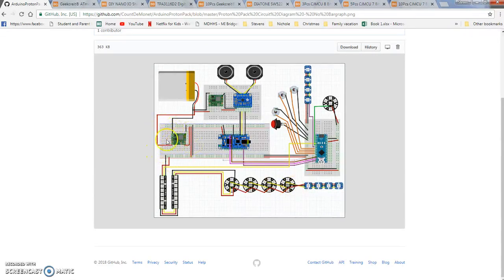This is what we call a buck converter, so it's taking your 11.4 LiPo and turning it into 5 volts and feeding it for this. And that way, this won't fry this. He has 2 because he was noticing some brownout issues with all the lights going. Brownout issues meaning it's dropping below the 5 volts or there's not enough amperage. So you can just use 2. Just don't crush your wires. You just have to keep it positive to positive, negative to negative. It just supplies more amperage so it can run everything.